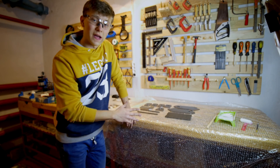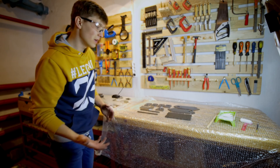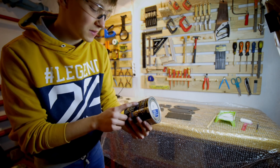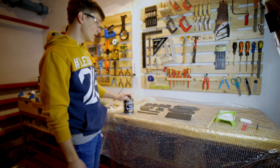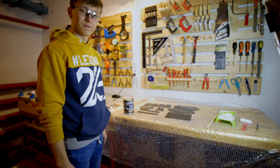The parts are super clean now, which is very important if you want to paint them. I really recommend painting to protect them from rust. I will use Hammerite paint — probably a few layers just to make it look nice and also protect it properly.